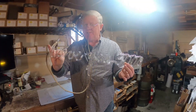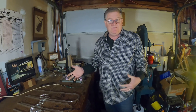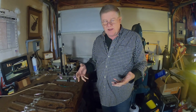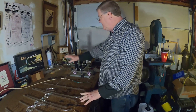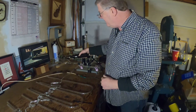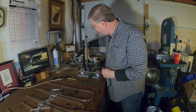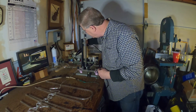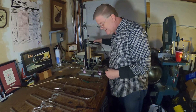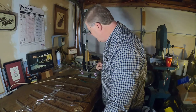There's our Love U3000. I'm going to put a little tubulation on here so we can hook it up to the manifold. The next thing we're going to do is get the unit ready to be filled. The first thing you have to do is heat the unit up to over 500 degrees to get all the impurities out. Over here is a manifold with two gases hooked up — we have one filled with neon and one filled with argon. That's got the argon blue gas in there, and that's got the neon gas in there. Before we get to putting the gas in, we're going to hook it up to the manifold.